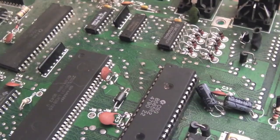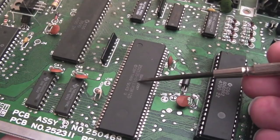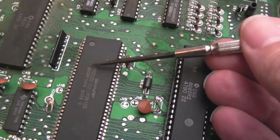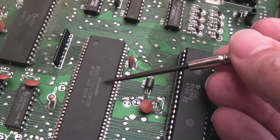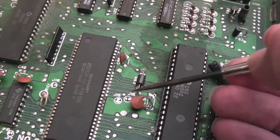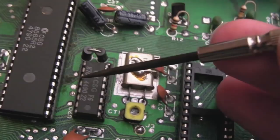From the description this is having some sort of colour faults, so my first thought was the SRAM internal to the PLA. I think this is a 64E - you can just about see if I move the camera over here. Now on the version prior to this, the PLA was a shrink DIP, manufactured by Sharp. There's another video you should check out where I reclaimed the chips - 'One Took It for the Team' I think was the name. On that revision you had a 2114 SRAM for the colour.